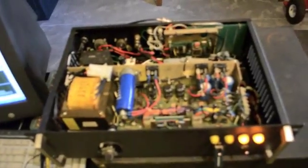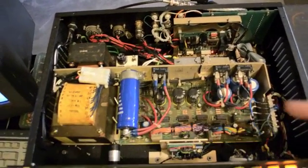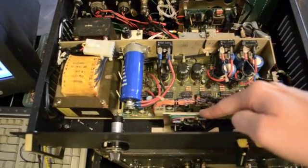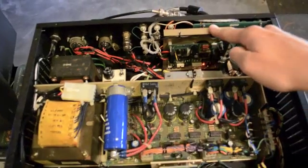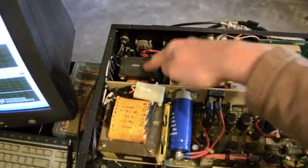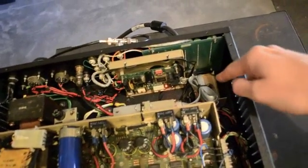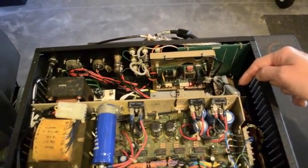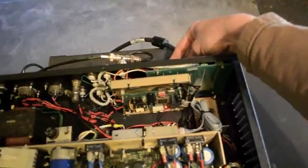Inside you see a DC power supply, linear. This is the ramp generator — it's an analog ramp generator which is triggered digitally by the PCI-6014. Back here is a motion stepper motor controller for the linear rail. This is the power supply for the linear rail — switch, fuse, rectifiers, and so on back there. This is an active low-pass filter down here for the DAC output, in case we want to use that to modulate the YIG oscillator. Back here is a breakout board from the cable that goes to the PCI-6014.